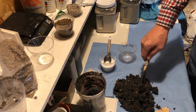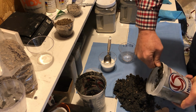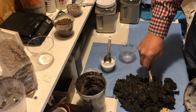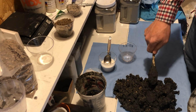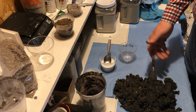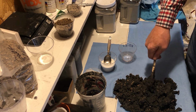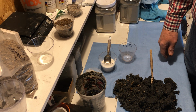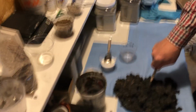Getting back to this material, here's one that I did at 5%, which was just 1 ounce. That is tight. So look at that, 5% by weight power pellets to manage this 45% moisture sludge. Look at that. By using this material, you're going to reduce your cycle cost of mixing and handling and hauling and disposal by 65% more than likely. And if you were to use high calcium lime or Portland cement, you're adding 75 to 100% weight, sometimes more, to your haul off and disposal costs. So, why do it, when you can do it for 5 to 7%.